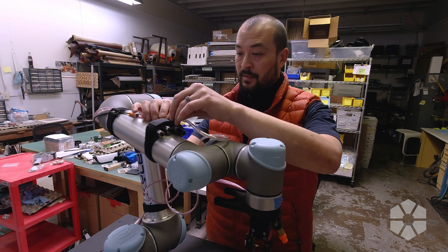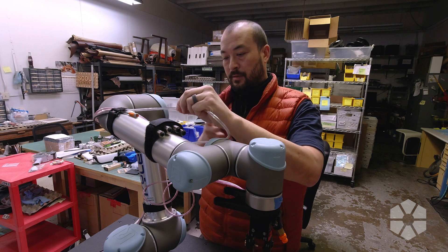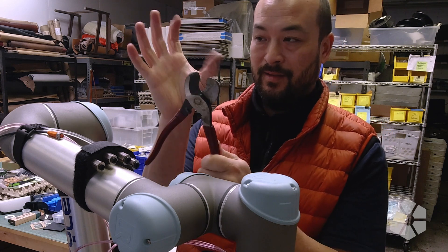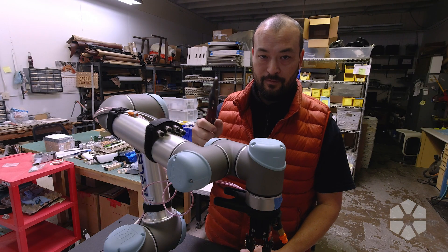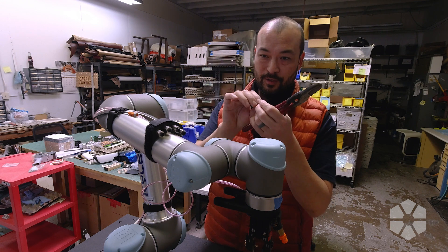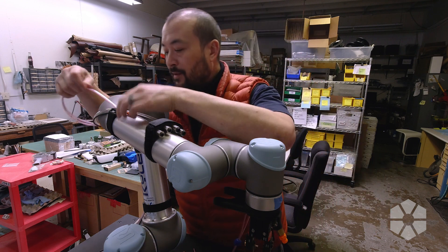I guess I have to start cutting some airline and making this situation more permanent. I'm actually only using one of the six millimeter hoses at this point. These are actually wire cutters but they're a two-sided cutter with curved jaws. A long time ago I learned that it was much better to use a curved jaw double-sided cutter — if you use something like diagonal cutters you end up most often with a diagonal cut and it actually squishes the tube. This will give you a square cut.